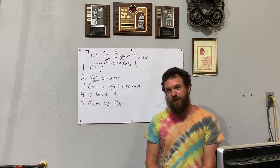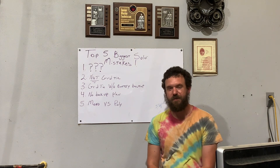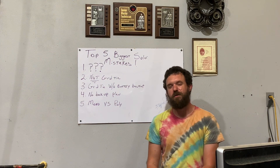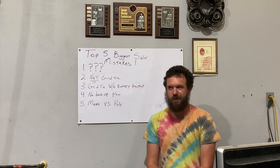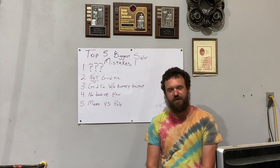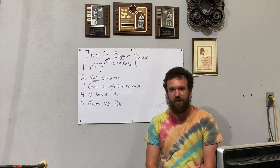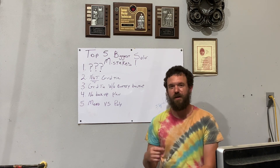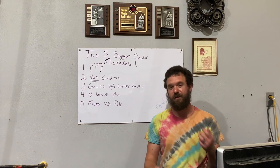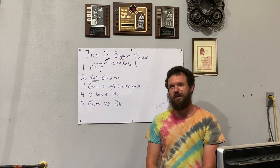The second reason not to put solar panels on a roof: the efficiency of solar panels is quite low — 18 to 20% on some of the best panels. The thermal energy coming off the sun is huge; there are thermal inventions that are 60% efficient. The sun hitting your roof puts an extreme amount of thermal energy onto your house that you cannot offset with the power coming out of your solar panels. On a hot, sunny day with panels on your roof, your roof could be 170 degrees and your air conditioners have to run really long to cool the house down. You would be far better off planting trees to shade your roof, cooling your house, and buying electricity from your power company — based on efficiency, you would save so much more money than putting panels on your roof.